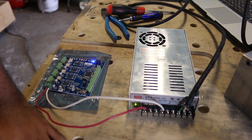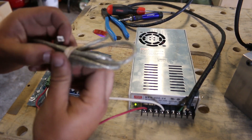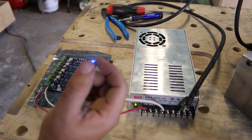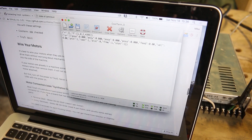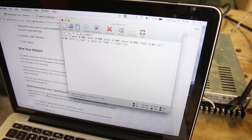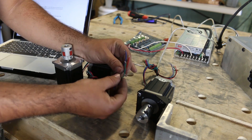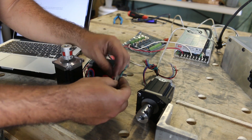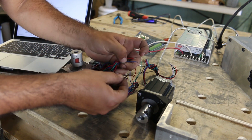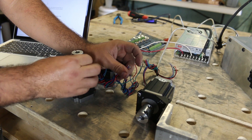Of course I do not have a USB cable with me. And we're back — I did not run home; I bought this from Goodwill for 79 cents, and I got a rubber band out of the deal. Now it says to connect the motors, but it says don't connect them while they're in the machine, and I've already put them on the machine. I've got my motors out. Basically the instructions say to find which wires are pairs — normally green and black, and red and blue are paired wires. You can test for sure by spinning the motor by hand: it spins freely normally, but when I short green and black, it's really hard to spin, and when I let go, it's easy.